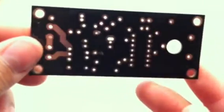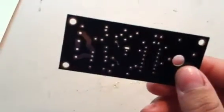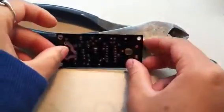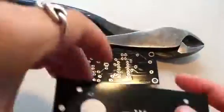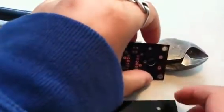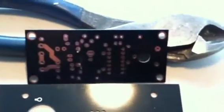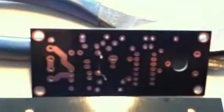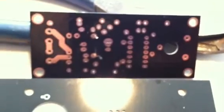I recommend soldering like this so you have better access to the joints. I also recommend using gravity as your friend in this situation. Because you're transforming the solder from a metal into a liquid, it's going to run. You want gravity working for you rather than against you, so you want the solder to run down into an area where there aren't as many joints — that way you're not accidentally soldering a joint you didn't intend to.